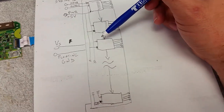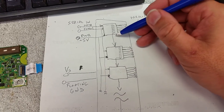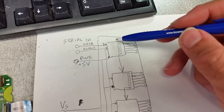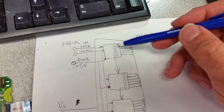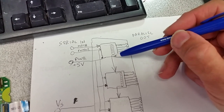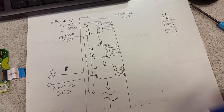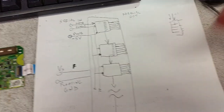So here's what a buffer board is, and it has all those ICs, those ones, and they're connected in a serial fashion. Every single one has an input that takes data in a serial fashion. That was 0 and 1 going in. And every time 0, 1 goes in, it fills in the top cell, and all others are being shifted down the opposite order. First, everything is being shifted down, and then the very top is being populated with whatever came in. But the output goes to the next IC. It serves as the input for the next IC. And so, if you have so many of those registers connected in a serial fashion, you can fill up so many bits of information with so many steps or clock turns of this.